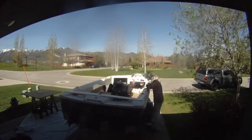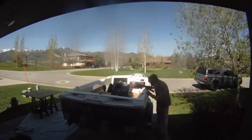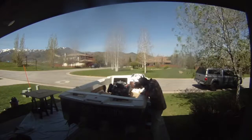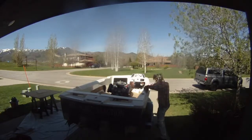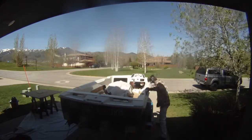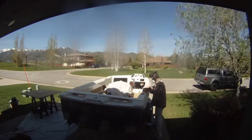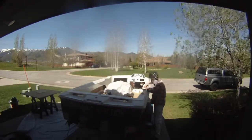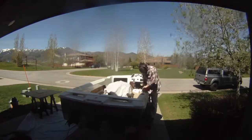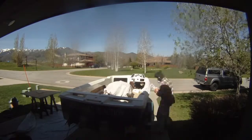Now I'm on to making moves and getting this thing closer to being finished. I went around the boat and took off all the little snaps for keeping the boat cover on - removed them all because I'm going to have to paint. Here I am block sanding the gunnel where the tree fell on in the hurricane, just trying to get it smoothed out and matched up so it looks really good for painting later. I used a two-by-four with a sheet of 60-grit sandpaper. Got it pretty good early; eventually I'll have to come back and do some more fairing. Felt kind of good to be finally shaping it. This kind of work takes hours where you just have to stand there, focus, and sand away.